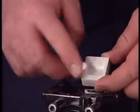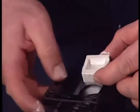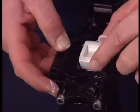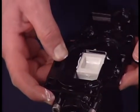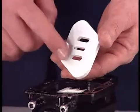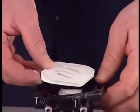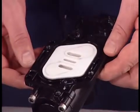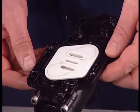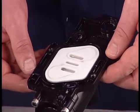Lubricate the ceramic valve insert and install it into the valve block. Make sure the concave of the insert faces out. The radius of the concave should be parallel to the spool. Now lubricate and install the ceramic valve plate over the insert. Make sure the plate lies flat — the polished side should face the insert and the dimpled side should face out.